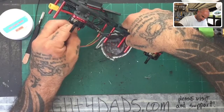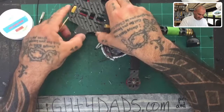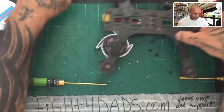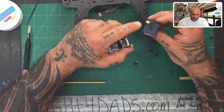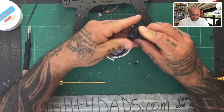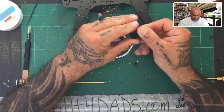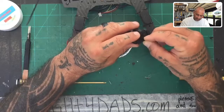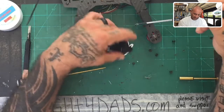We'll put the camera on and then get back to finishing this build, or at least putting the flight controller on. So here's our camera, and here are some of the screws that came with it — these real small ones. The camera goes with the top oriented correctly as marked. You can put it in the middle of the bracket if you'd like — there are three holes right there. You get full swivel without any issues, and you'll need a small Phillips head to tighten this down.